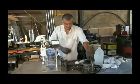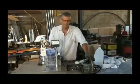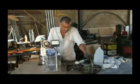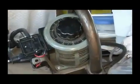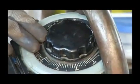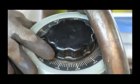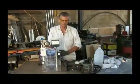Now we've plugged in our variac. I forgot to tell you what a variac is — this is a really big volume control like on your stereo, except it controls current and volts. It regulates how much current flows through it. Let's say we wanted to limit the current that goes to our transformer — well, we only turn the variac up to 10%.